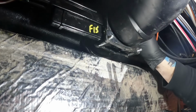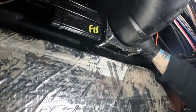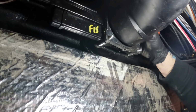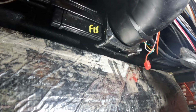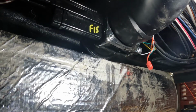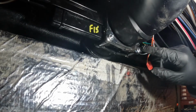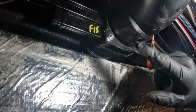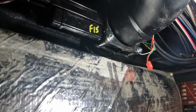Now that I'm confident that my seals are set properly and everything is in the right place, I am going to get my bolts through, and then for now I'm just going to get them all finger tight. And then of course, once you have everything finger tight, you're going to want to start tightening it all up. Which brings me to my next point, is that you're going to want to do all that evenly. You don't want to just go cranking this one down and then this one and that one. You might start creating some unevenness with those seals. Again, you don't want to leak.